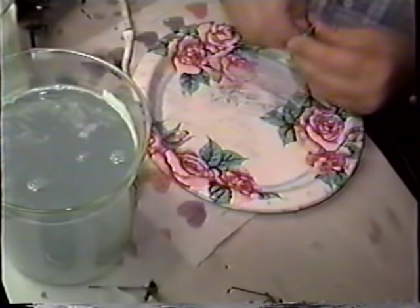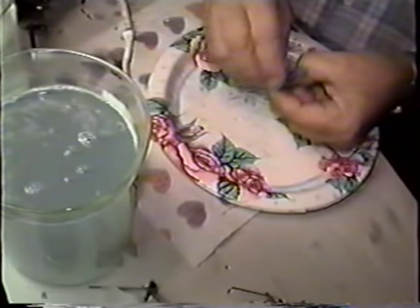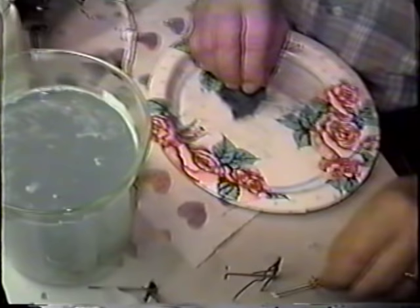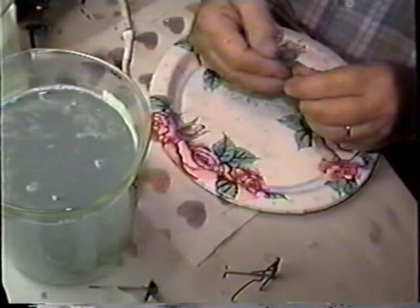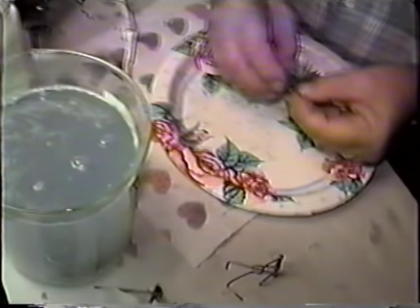And my escape wheel. Now, the escape wheel is a lot different than all the other wheels, so the teeth are different, so you don't really have to mark that one. And scrub it real good and make sure it goes into the cleaner. And I have my center shaft for my hour wheel. Clean that up, clean up my hour wheel and hour pipe, clean that all up real nice and clean, put that in the water, and my intermediate wheel, clean that all up, scrub everything real good and clean.